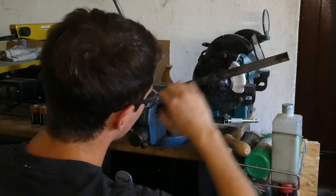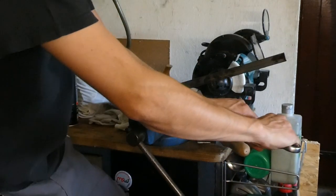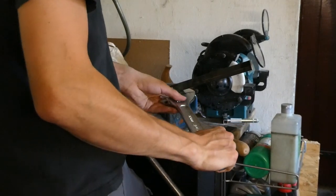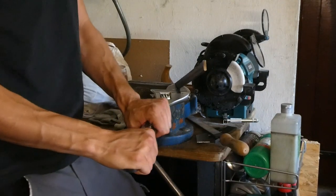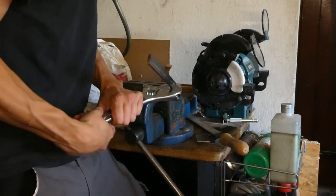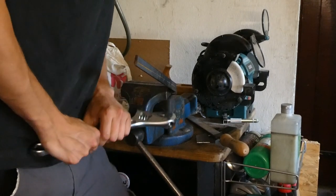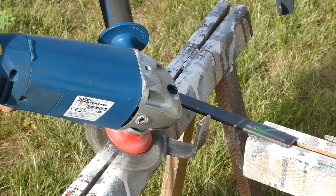Finally I bent and drilled some flat iron to fasten the framing to the wall. I bent them with two angles — the first being 90 degrees, the other being 15 degrees. This way water will always run from the wall side toward the espalier and won't run down the concrete of my neighbor's garage carrying rusty particles to the white wall. I also used some heavy-duty industrial silicone to seal the dowels.